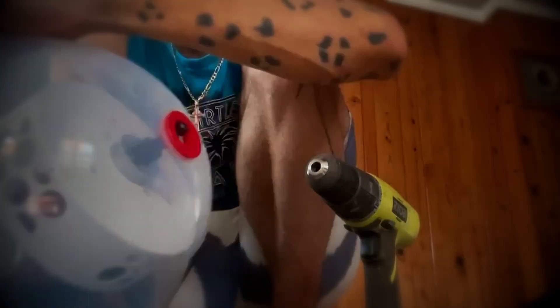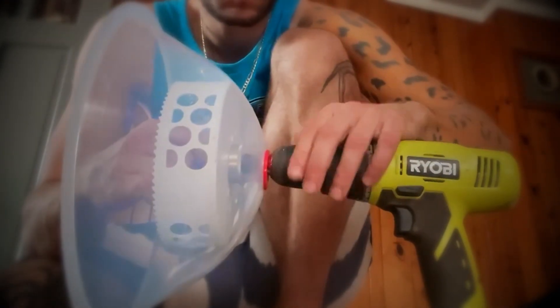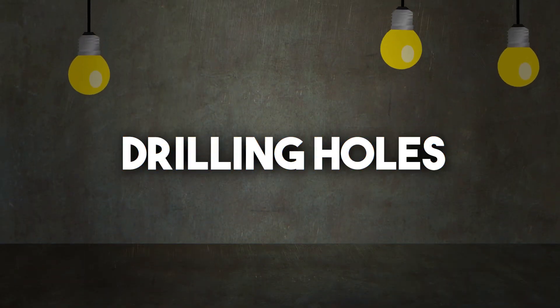The dust ball is made from silicone, is compatible with any hole saw, and will keep your workplace clean and free of dust. Put your hole saw with the hooked-up arbor inside the ball with the shaft out of the opening in the middle, and the shaft goes inside the drill chuck. You're good to proceed to drilling.